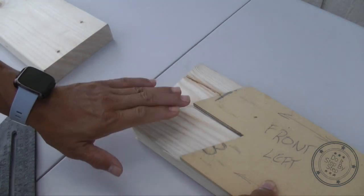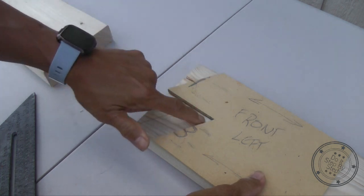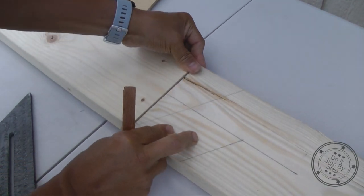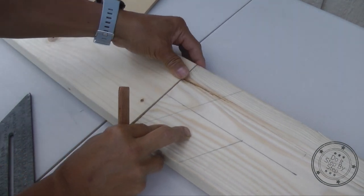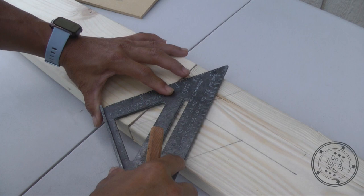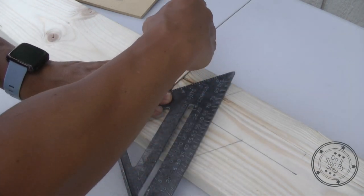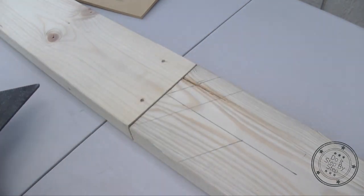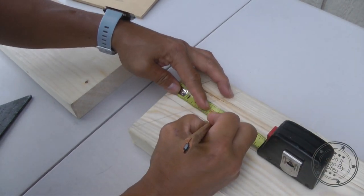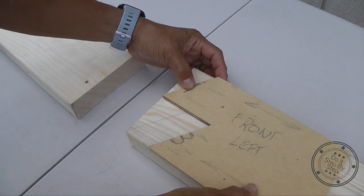Using the MDF template, you can see the waste that will be cut away. To maximize the length of the lumber and reduce scrap, we're going to move the rabbit joint cut lines to the edge. If you don't have a template, take a piece of 2 by 6 lumber, square it on the ends, then take your speed square and extend it to the other piece of lumber to locate the 30-degree angle to the very tip. From that point, it's the same exercise: measure, find your 30 degrees, draw your mark, add the center line, measure 3 and 3/16 of an inch from that tip down the center line, then locate the other 30-degree angle and cut.